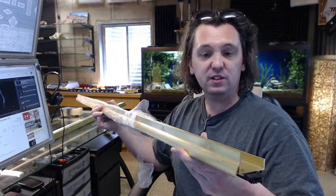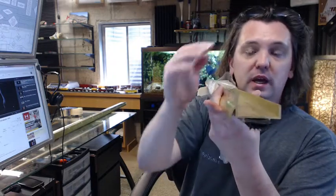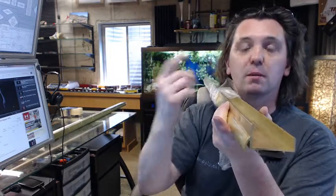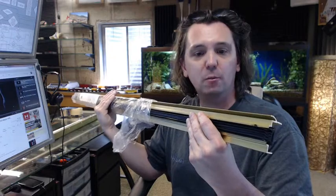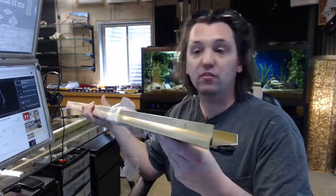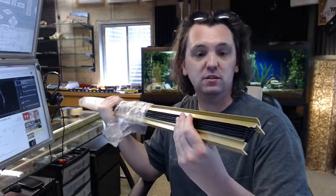A door bottom like this is going to be used where you need to seal the bottom of an exterior door, with an integrated drip cap, and used on a door probably made of bronze — like Chicago City Hall. The perimeter of that building has architectural bronze doors, and that would be an ideal application for something that's going to take a significant amount of use. The front doors to City Hall in a major city, a bus station, any extremely high-volume application could benefit from the significant investment in architectural bronze. This material is going to last for decades — that's the bottom line.